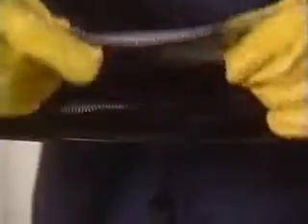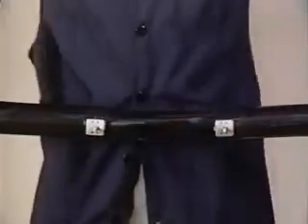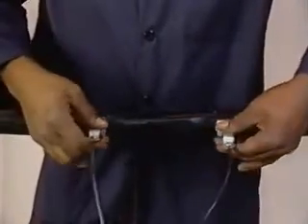Remove the exposed metal shield and dress the remaining edges of the shield to remove any sharp protrusions. Install bond clamps and a temporary bond as soon as possible. With solvent, clean the exposed inner sheath and thoroughly scuff the sheath around its circumference.